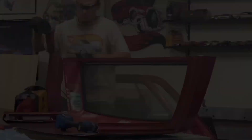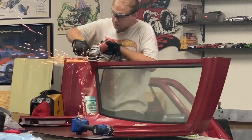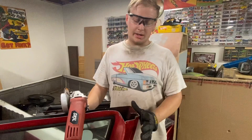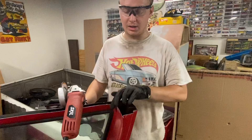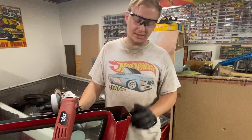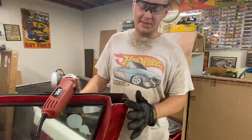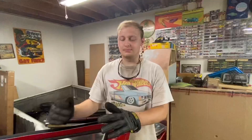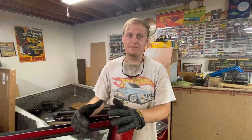Right now we've got the top off and flipped it upside down. When you use a die grinder or saw to cut, there are going to be a lot of burrs around the metal, and you won't be able to put any adhesive to it. So I'm grinding the whole thing smooth to make it nice and perfect so we can get these caps glued on. I'm going around the edges and the inside, making them all nice and smooth, taking some paint off to give the adhesive something to actually bond to. When it comes to grinding, it's hard work — you're sweating bullets — but you've got to do it to make it look good.